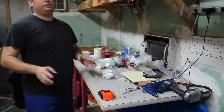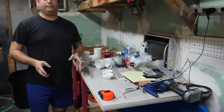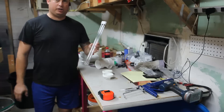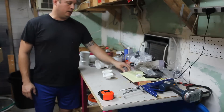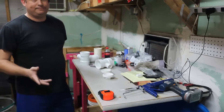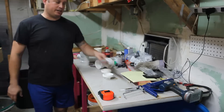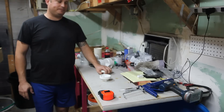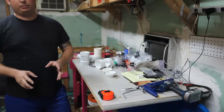Now, there are commercial units out there on the market. I don't like the way a lot of them are designed, and I think they're way overpriced for what they are. So I'm going to be using some PVC components, some standard 36-watt UV bulbs. You can purchase these on eBay for about $10 a piece. I'll be using a ballast that I got on eBay for about $6-$7, as well as some sockets that fit these bulbs. Those sockets are a couple dollars a piece plus shipping. So my total project will cost me about $70, and this will fit well in my form factor for my system, as well as help me control my operational costs.